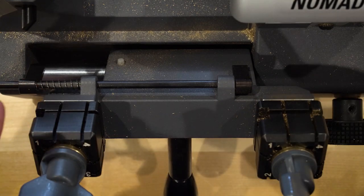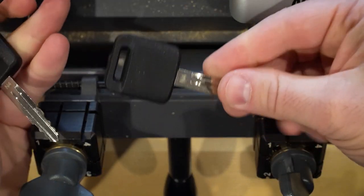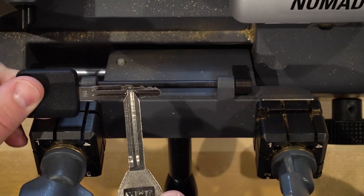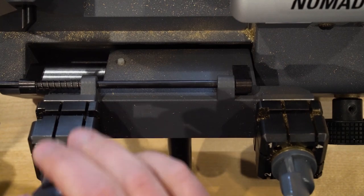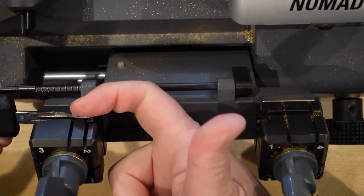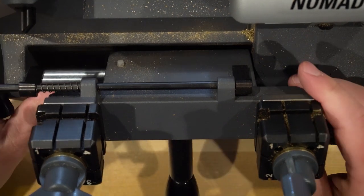Here we are at the machine with the NI04T key we're going to be duplicating. I'm just going to be using the DA34 test key for this video. Now, when any time a key has these big grooves in it like this one does, I typically like to bring it over to jaw C or jaw three. However, it doesn't work very well due to the depth of the cuts — depending on your machine, the cuts have to stick up higher than the key and I find it problematic using jaw three. Check it on yours, but for the most part you're going to be sticking to jaw one, or jaw A depending on your machine manufacturer.